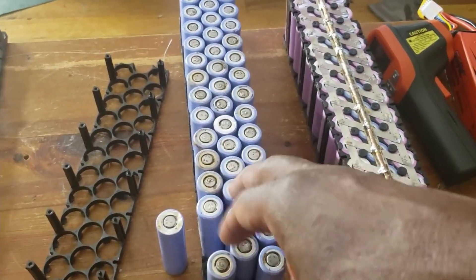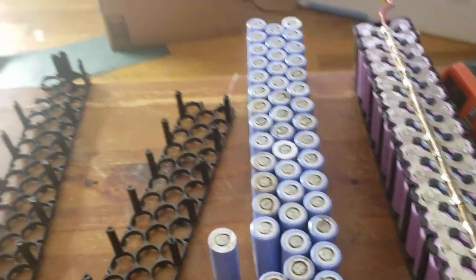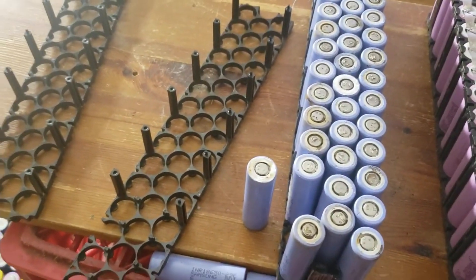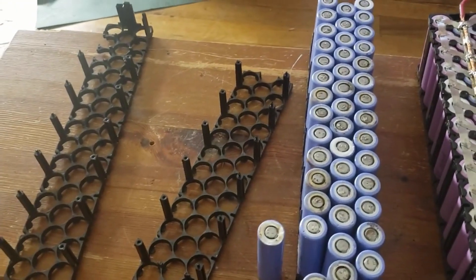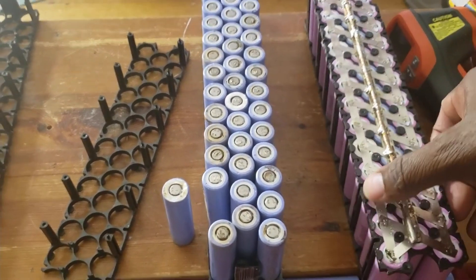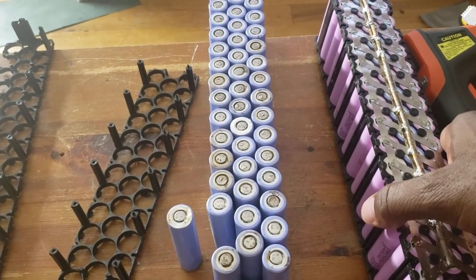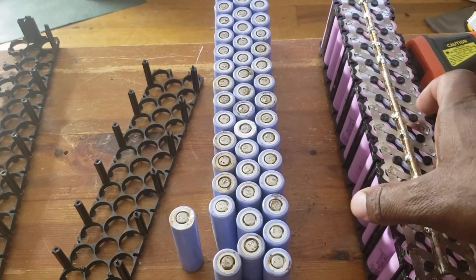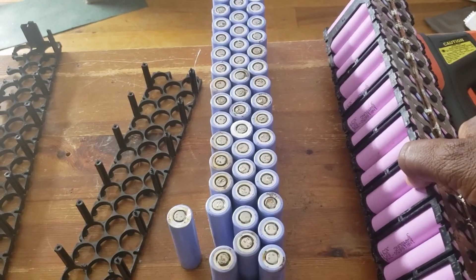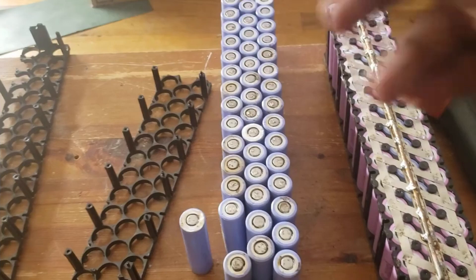I have some cells like that at home, so I put it together. This also came from an e-bike. I didn't want to put it in there. So first thing I'm gonna do guys, I'm gonna take the voltmeter and check every single one of them. Any battery below four I don't put in the pack. At the beginning when I was doing this, I think I forgot to do it in this pack, because I would have cut it before if any cell in there is below four. That's why we don't want to drain the battery when you put them in service. They put some load on it and you will have issues. So I'm just gonna redo the pack with different cells.